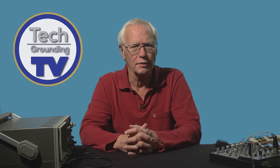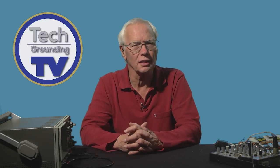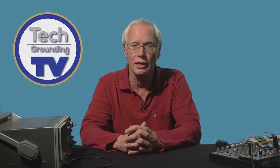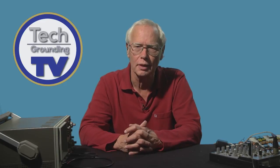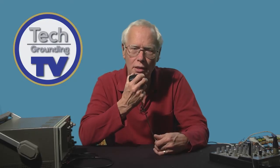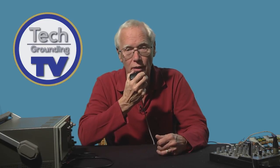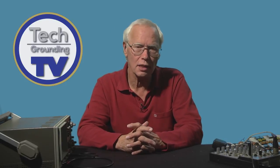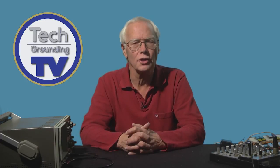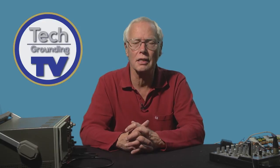It's on a much, much tinier scale, but of course it won't have those nasty resonances that the loudspeaker had. To give good sound quality, the diaphragm must be very light so that it doesn't resonate within an audible range of frequencies. That would distort the sound by adding extra volume to those frequencies. In the case of a mic designed for speech, like one of these press-to-talk communication mics, it's not a bad thing for the mic to have resonances at speech frequencies. It can actually add to the intelligibility of the speech. But with mics designed for music, the resonances must be eliminated as far as possible. Generally speaking, the fewer resonances a mic has, the higher the price.